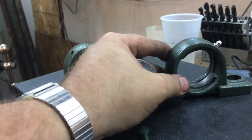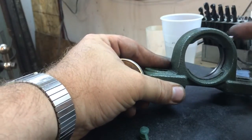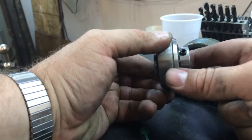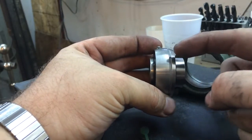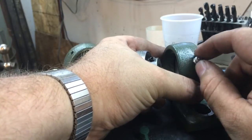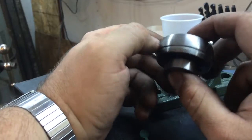Once that's rotated out, we can inspect the interior of the casting — it's looking pretty clean. It's got a nice clean groove for the grease to follow when you pump it into the grease zerk. Each of these bearings has a groove going around the entire periphery of the outer race, and usually in a couple of spots you've got some small holes for the grease to travel into and lubricate the roller balls inside. That grease comes in through the grease zerk, which sometimes comes separately inside the package, follows an inner channel, and eventually makes its way around the groove and into one or two of those holes.